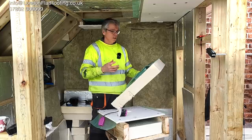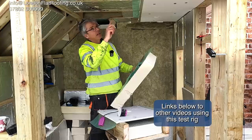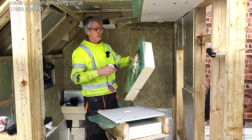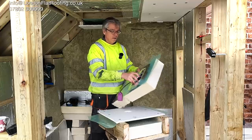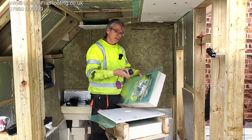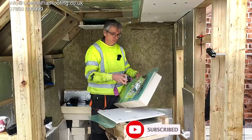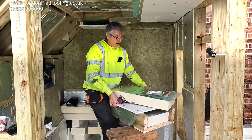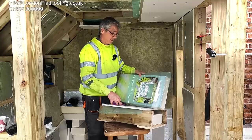Yeah, look - I can do that. I've got to tell you it's raining outside; this is a test rig and I'm going to be showing you all sorts of different things with it. You could put that all together, cut through your plasterboard, stick your light into that - but is that enough clearance around the outside? What about the clearance between the back of the light and the back of that piece of plastic? Do we really expect that anybody on a building site is going to be able to do all of that, make sure it's airtight, and guarantee it? I think not.